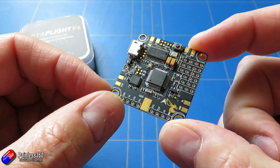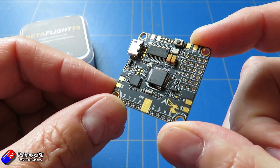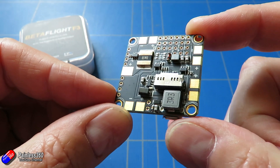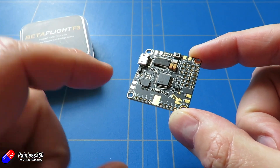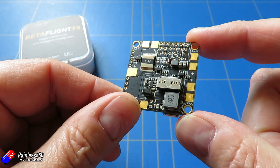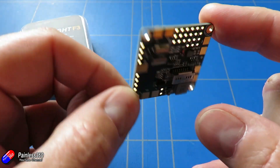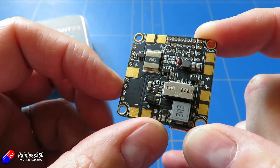Normally we'd expect a separate power distribution board — we don't need that, no external OSD, no external bits at all. But because of the limitation of space, there are pads at the bottom mainly for power, plus a couple of other things we'll talk about. Because some pads are underneath, we're going to have to solder things to the flight controller before installing it — including the ESCs and the main power battery wires. Once those power connections are made and a couple of other small things are soldered, we can pop it onto the model.